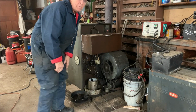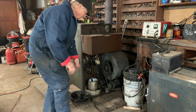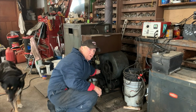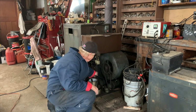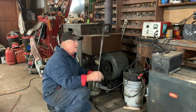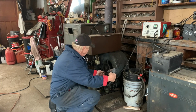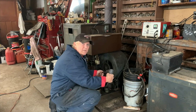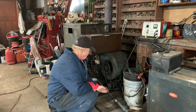There's another thing I forgot to mention. When you get out there first thing, just before you're going to light it, there's a little cap here. This is the tube for where the oil runs through to go into the burner. Take this little copper cap, just unscrew it. And I got this drill with it, with a long drill bit on it. And you just run that drill bit through. You'll feel it, there'll be some carbon buildup. So anyways, you run that through back and forth 10 or 20 times. And then just put the cap back on and go from there.